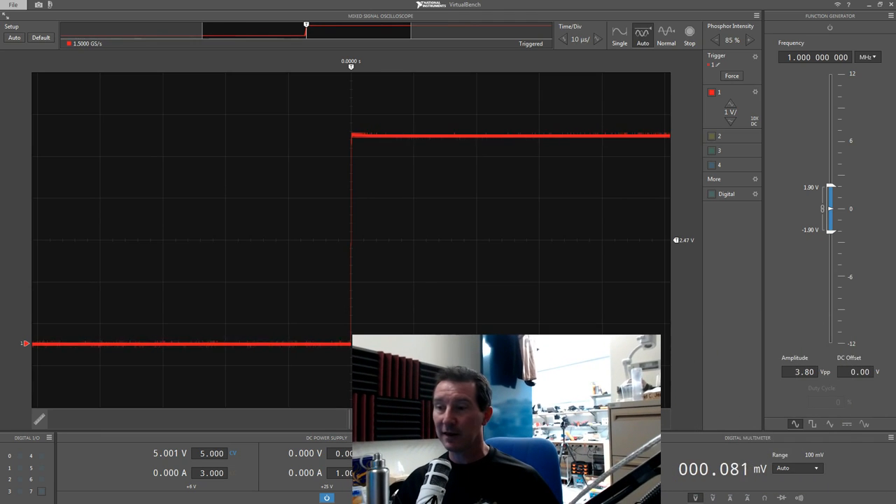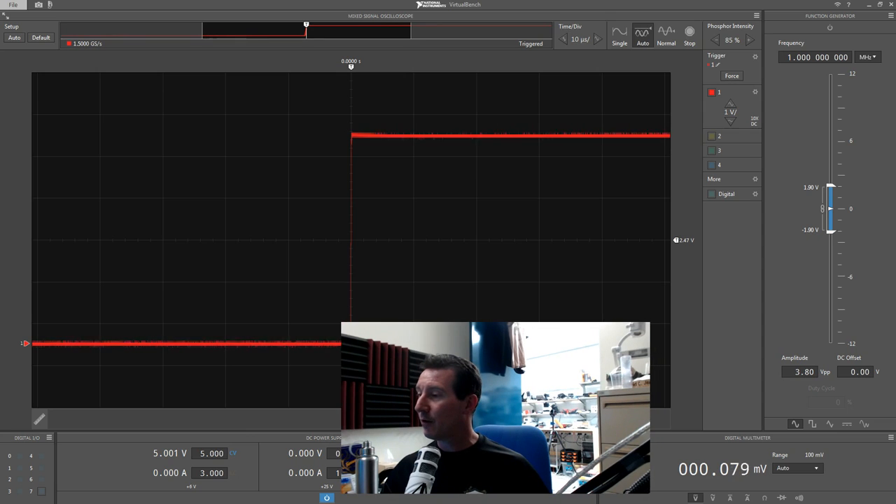This is great — you're certainly getting your money's worth. It shows constant voltage mode and will tell you when it switches to constant current mode. Here's the digital multimeter panel — volts DC, volts AC, the fonts are a bit small. It goes down to the 100 millivolt range with 1 microvolt resolution. Everything's hunky-dory — I like this thing.